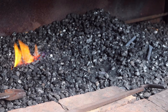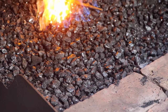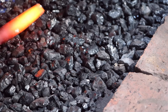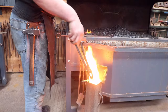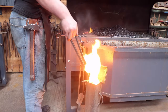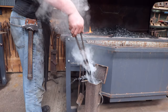Time to put these tools into the fire for the final time and begin our hardening process. Remember, there are different thicknesses here and we don't want to accidentally burn off a thin filed end. If you're using a solid fuel fire, I recommend a nice slow roast on top of it and allow the heat to seep through slowly. We only need the working ends on the tools to be hard — you should find this gives a bit more shock absorption on the back end. And once we have a nice hot working end, we're going to move the steel from the fire to a nice vat of oil in a single quick motion. You'll notice that my hand is at an angle here — I don't want those flames shooting directly up my arm. I have precious little arm hair left as it is. The reason we are using oil here over water is that the oil is a little gentler on the higher carbon steel and doesn't cool it too quickly, which in this case would make the work a little too brittle and may even crack in the quenching.